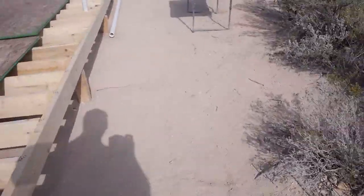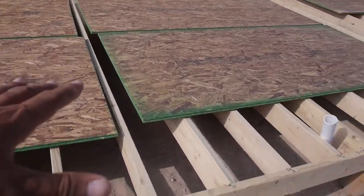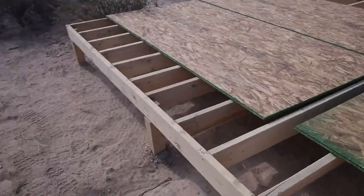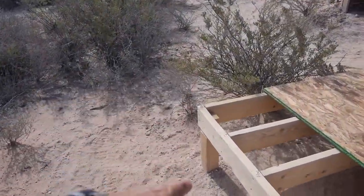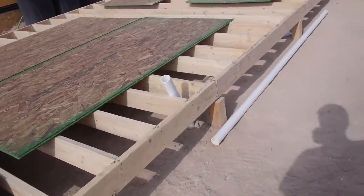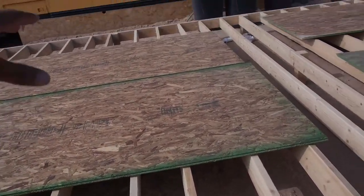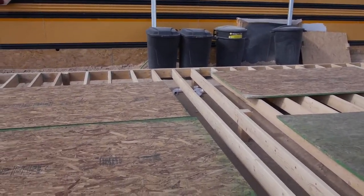So, what I'm looking at, before I can put the subfloor down, I really want to run my plumbing, just to rough it in if nothing else, so I don't have to crawl under the house, because at best, that post is about 16 inches, so you drop down 6. I've got less than a foot probably on most of the house. That would be awkward at best and impossible at worst. So I don't want to be doing that. If I can lay the drains in now and pull the PEX for fresh water, and then put the subfloor down, then I should be good.